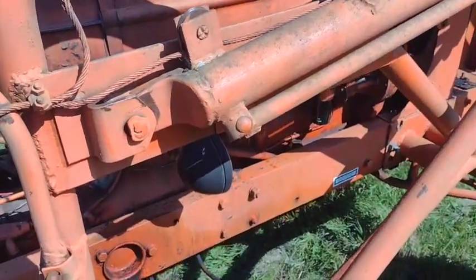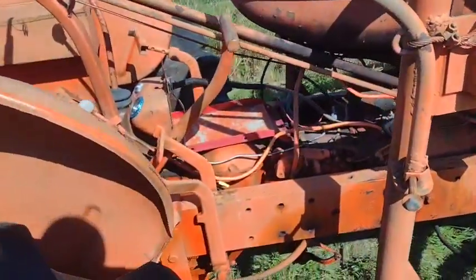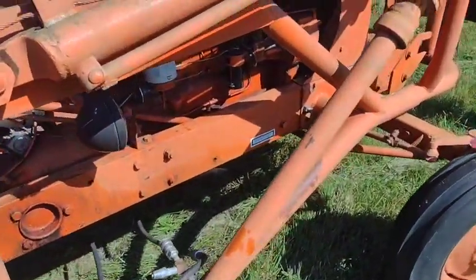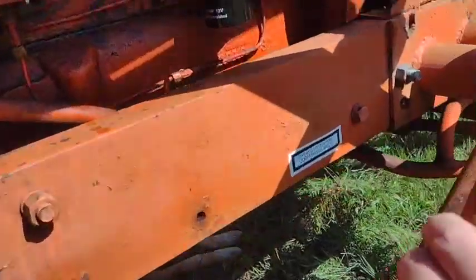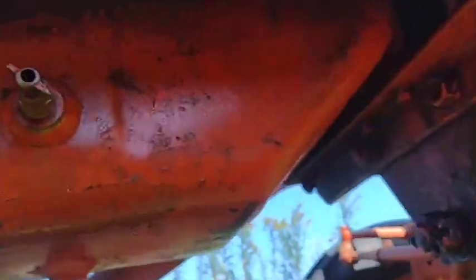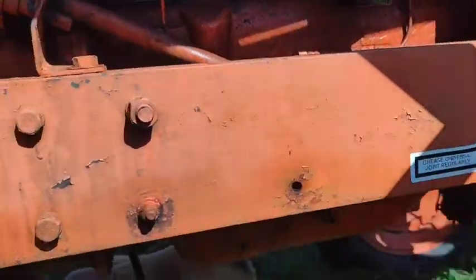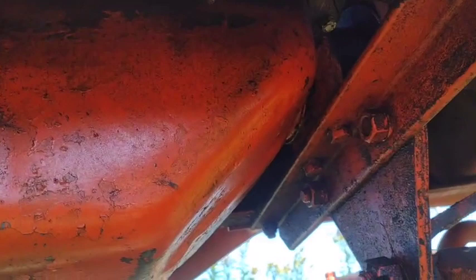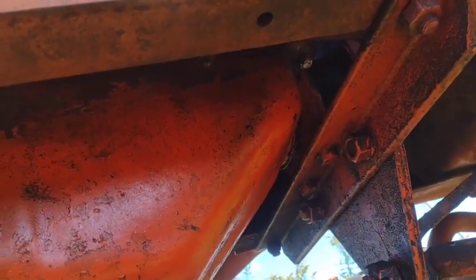There are at least four absolutely horrible design aspects of these tractors I can think of off the top of my head - any one of which would be kind of a deal breaker. First, these use a cork gasket design on the oil pan and they basically all leak. It's a five-piece, seven-piece cork design. I'm amazed they ever sealed at the factory. This one doesn't look like it's leaking though, so maybe somebody got in there and replaced it with RTV silicone.